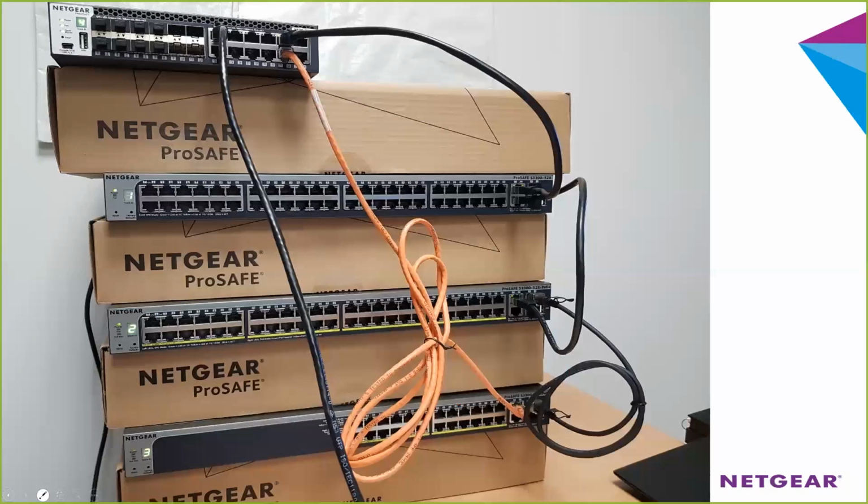Second, we don't see the V6 firmware on the 4300 on the website, only the 12.0. That's normal because that's only for the 3300 customers. So you will find the 6642 and moving forward the 664X branch of software both for 3300s and 4300s on the S3300 web pages. Why? Because we don't want to add any confusion for the 4300 customers. This only addresses 3300 issues and customer requests for adding 10 gig onto the 3300s. So the 4300 firmware is bundled with the 3300's V6 firmware, to answer your question. So go to the S3300 page instead.